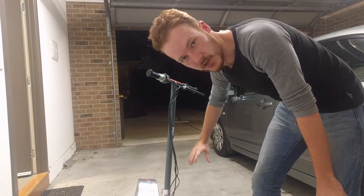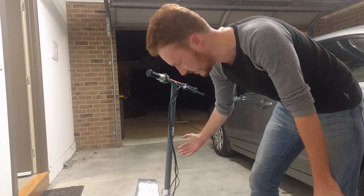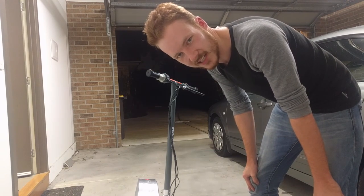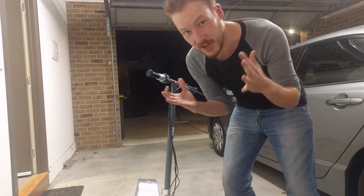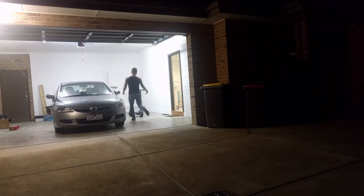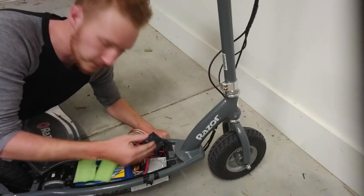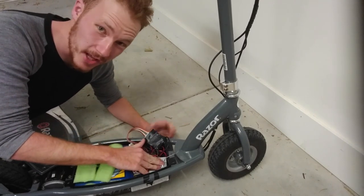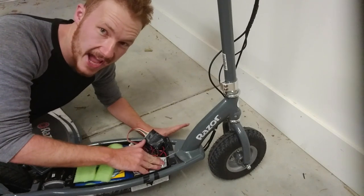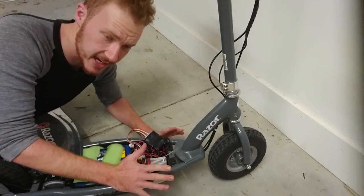I have to be really careful — it still could blow up if it gets hot, so more testing to be done. I'm just so pleased that it actually does work. It's actually spinning the rear wheel. It's got so much power right now. I just can't believe it didn't go full throttle and spin me into the bushes like last time, because that was terrifying. Holy crap, we did it. We paralleled FETs. Nothing blew up in the first five minutes. That's incredibly impressive and I am stoked. It's actually so fast, it's scary.